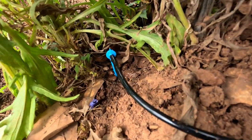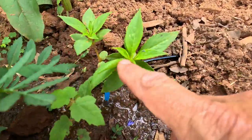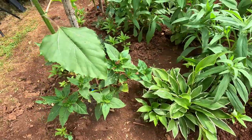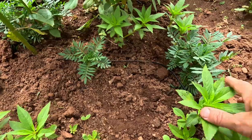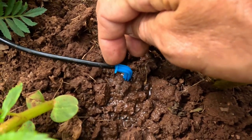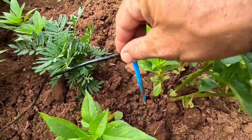Check out what it's doing right now — right under there, look at that drip going on! Some of them you might look at and think they're not dripping, but that's because I pushed the hose all the way down. Look at this one — there's no visible drip, but look at how the hose is butted right up against the drip spike. It's just dripping right off of that spike.